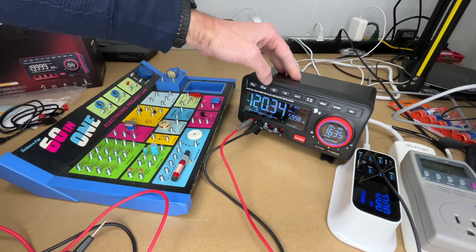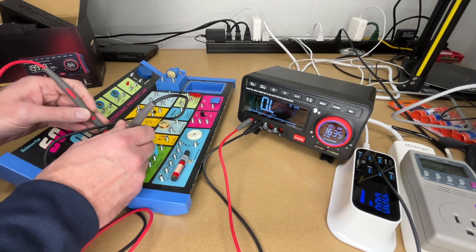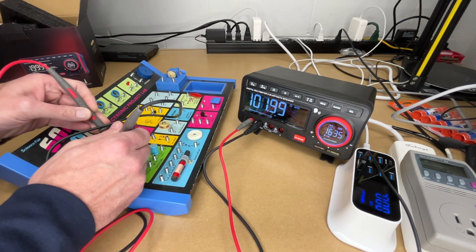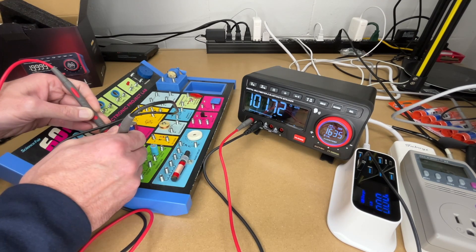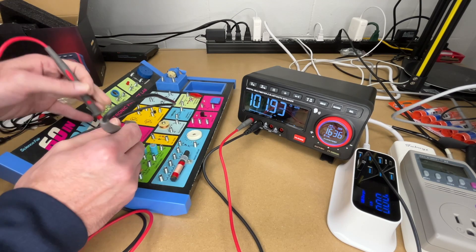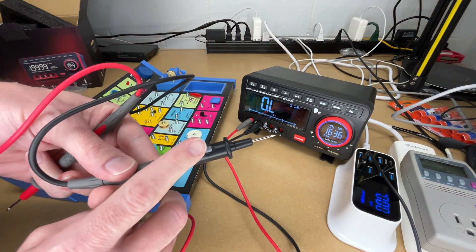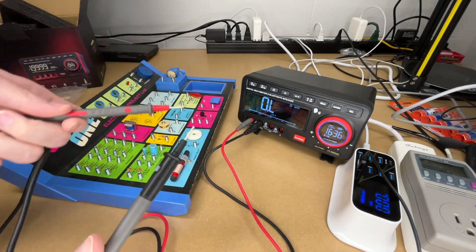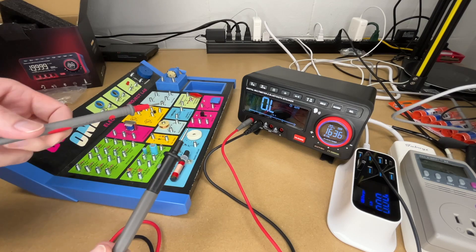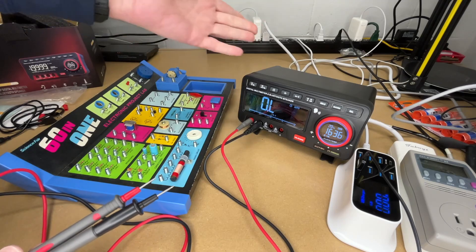But this thing has even more than that. Let's go back to ohms and look at a 100k resistor. On the com probe there's a button, and when you press it, it will read the screen aloud. The meter spoke: '100... 0... 1... 0... 0... ohm.' So if you're in your car under the dash reading a value, you can have your probes under there, focus on what you're doing, hit that button, and it'll read it to you. That's worth the price of admission on this alone.